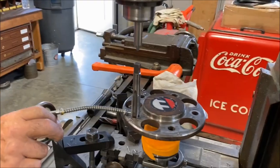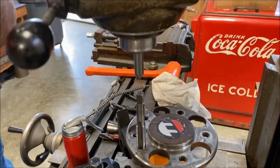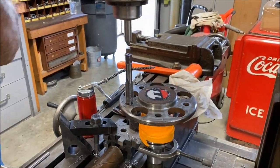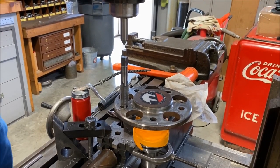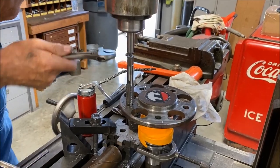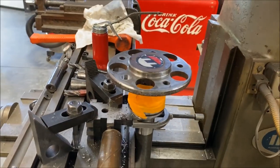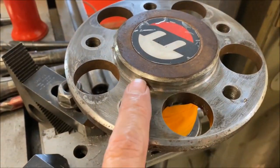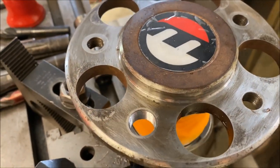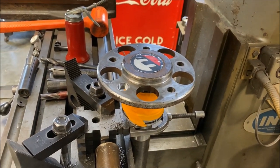Got a little lube there, taps right in. I never knew what that little hole was in the back of a tap, but it's a centering hole. So you see the process. Here's the job all well done — look at that thing, that's perfect. A lot better than I could do with a drill press, and straight. That's the importance of doing it the right way the first time.